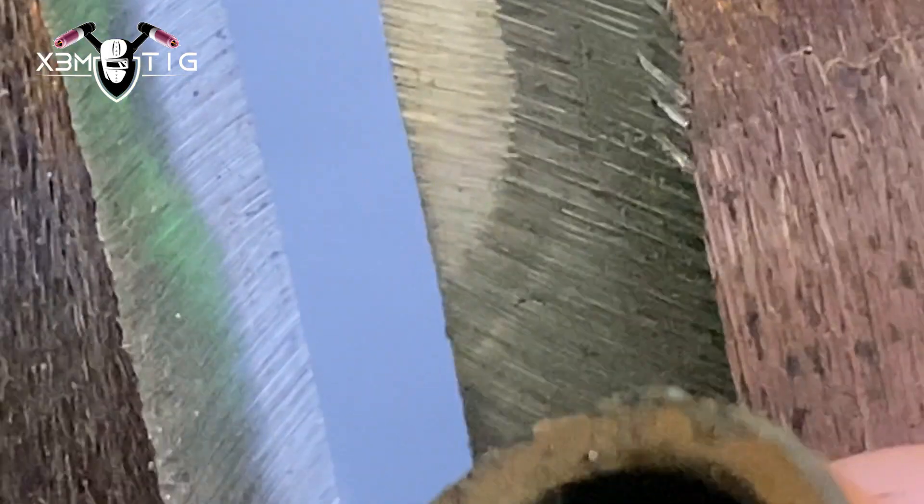The other thing: once you're in position and start welding, don't forget to turn on the argon. And if you got tungsten that's contaminated like this, definitely change it — you don't want to continue welding with this. This shape might be fine for aluminum but it's a different setting.